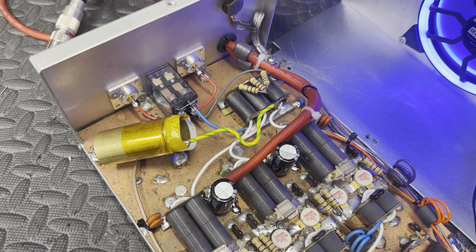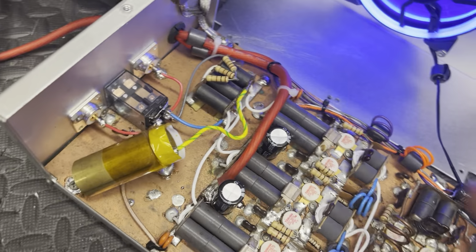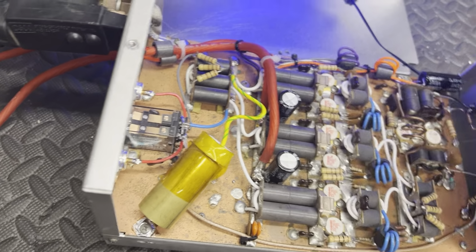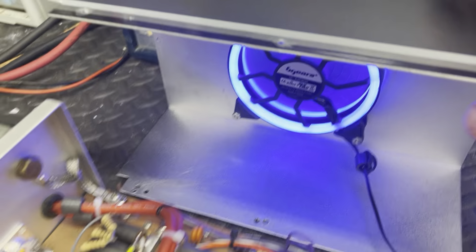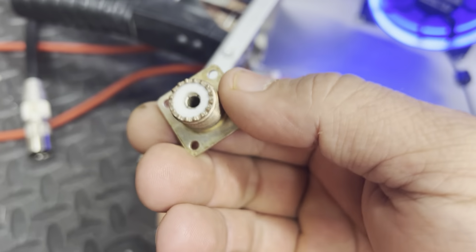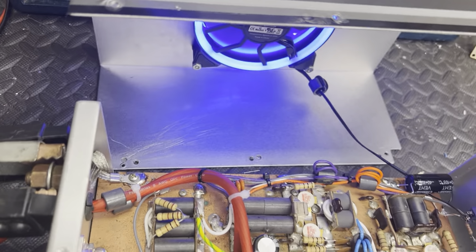There's more. I got to think of it. It's quite a bit of a while I spent on this box. I zip tied all the wires up and everything. Tried to neaten it up a little bit. Put some zip ties on the coaxial wires. Oh yeah, wired the fan up. I know I'm forgetting some. Oh yeah, PL259s are wore out. They're just loose as a goose, so I put new ones in the back of it. Good ones. Teflon. I think that's about it.